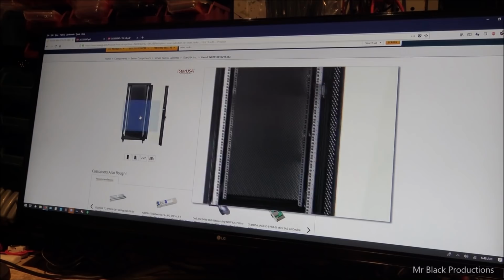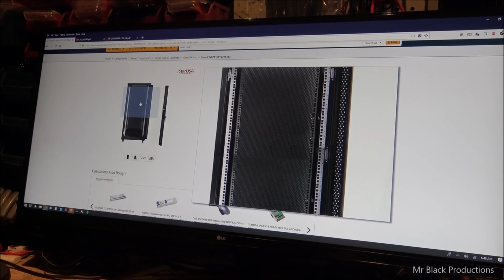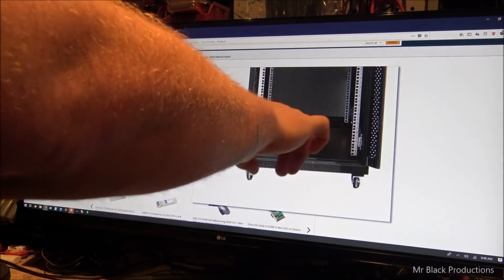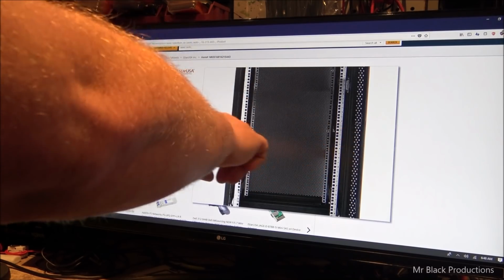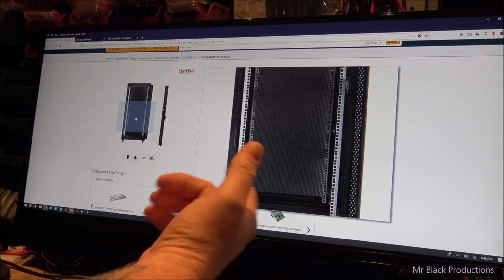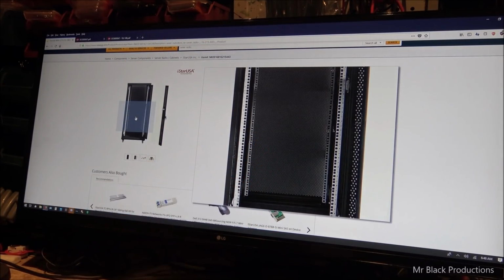All steel construction, a modular lattice line on the inside. So what we'll have down here on the bottom is our plate transformer, and then up about halfway in the deck, or in the amp, we'll have another shelf, and in here we'll have our filament transformer, our time on circuit, our time off circuit, our soft start, all those kinds of things.